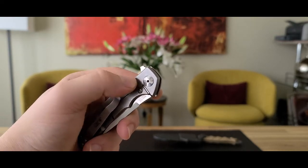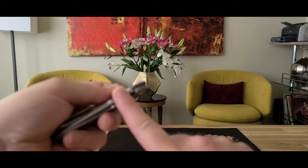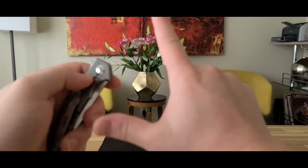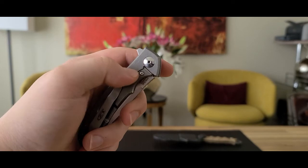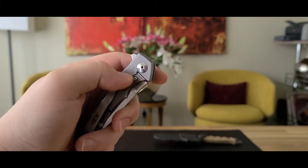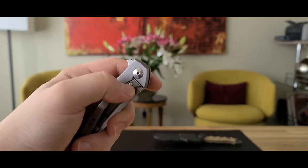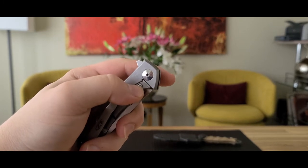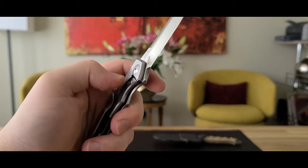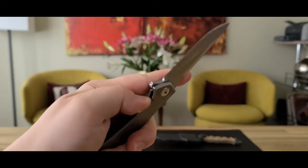And so the idea is there's a little tab back here on the frame, and it sticks up and out a little bit, up this way, up off the knife, right? And it's kind of roughly L-shaped like this, and it sticks up off the knife, and the bend of the L is pressing up against the frame, not against the frame lock, but up against the frame. And then the other end of it goes underneath this screw, right? Like, so you can imagine like essentially a washer that goes underneath this screw, right? So that if you were to press this tab, it would essentially rock the washer up and pull this frame lock mechanism up away from the blade.